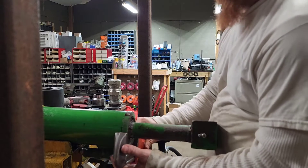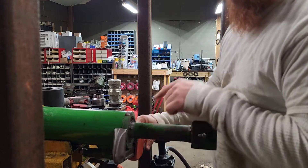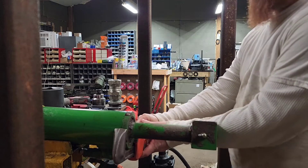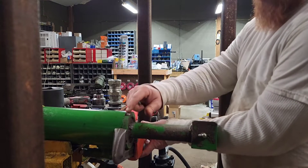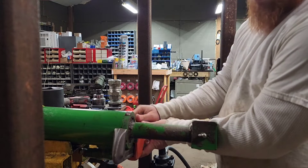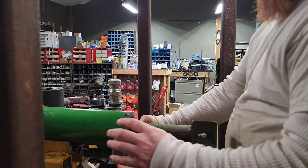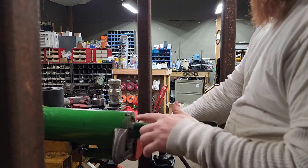One reason why I'm using a pipe wrench and not the actual spanner wrench is these T's right here. We put a lot of pressure on them with just that one hook — they tend to break out, chip, break off and then they're really no good after that. So I'm taking a pipe wrench and just going around the outside nut.